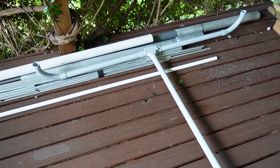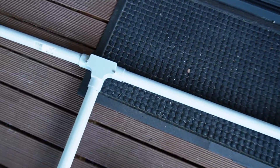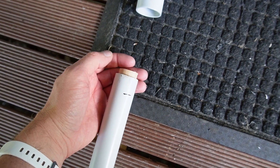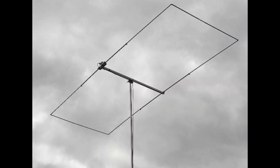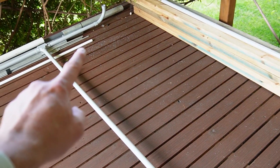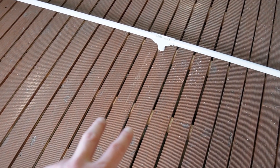So that's project number one. Let's move on to project number two. This is a frame for a 10 meter Moxon antenna which I'm going to build. This Moxon is made out of PVC — actually it's heavy duty 32 millimeter conduit. I've just got some thick dowel which runs through the center there to give it a bit more rigidity. So basically the idea is it's going to be a wire antenna. A Moxon is a two element beam which has the ends folded in for restricted space. One element runs from one end of the frame to the other and then it folds in here, and then there's a little gap and the next element goes around and folds in a rectangle. The driven element has your coax attaching about here.